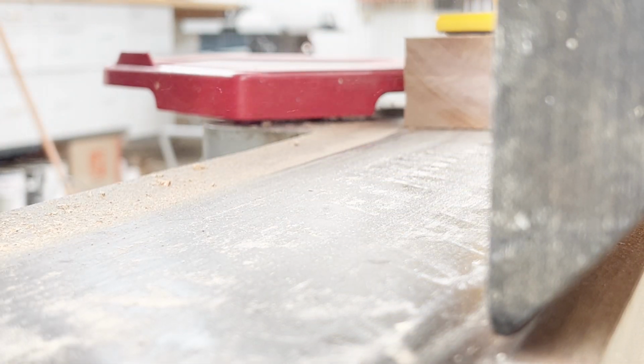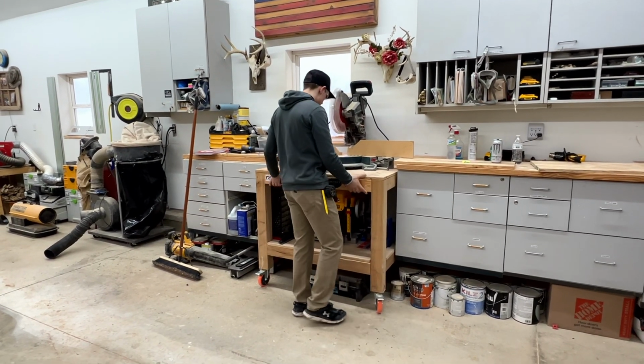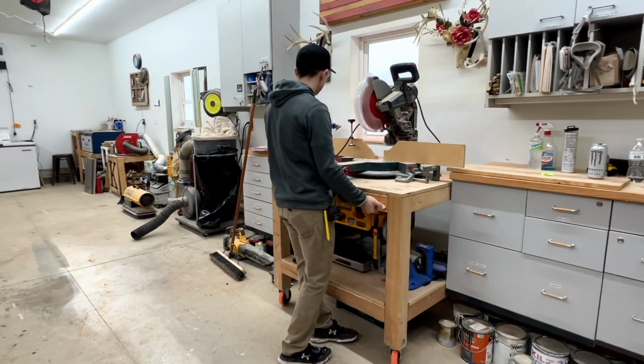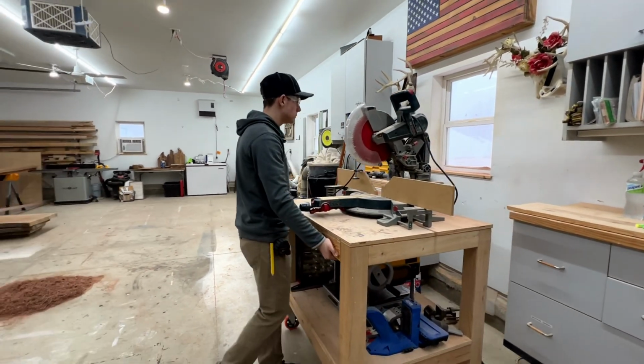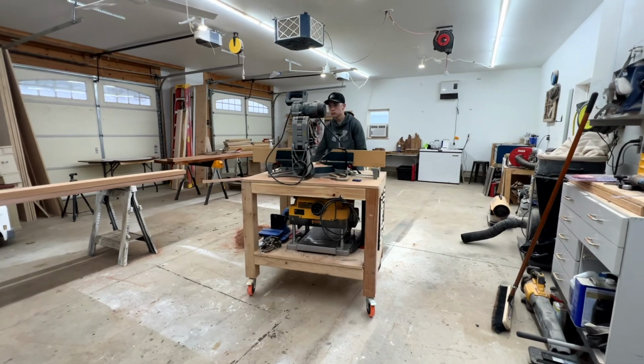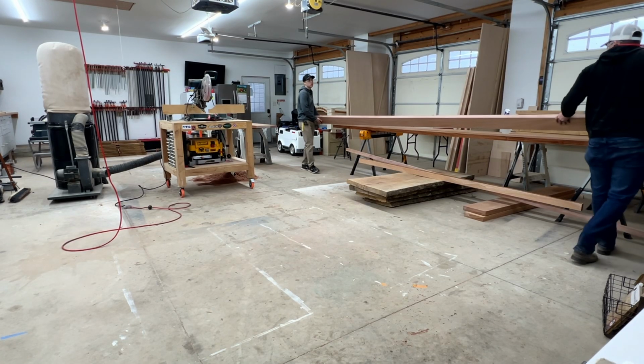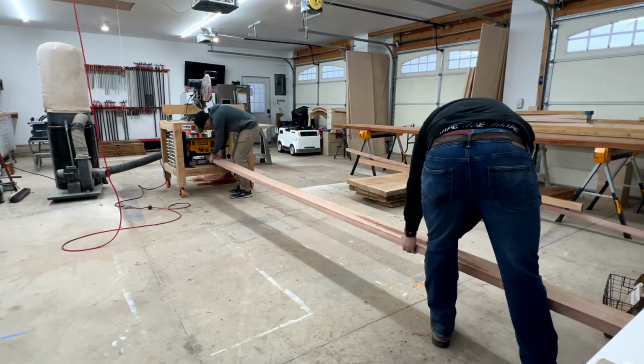To compensate for the loss of power, you'll often find that you have to make multiple passes to cut through the stock, instead of making one full depth cut. This adds time, but also compounds accuracy issues. The more passes you have to make, the harder it is to keep everything perfectly aligned, especially over the length of 17 foot. When you're cutting or joining a 17-foot board, even a small deviation can turn into a massive error by the time you reach the other end.